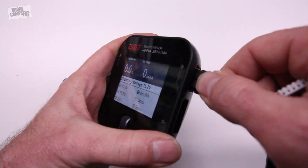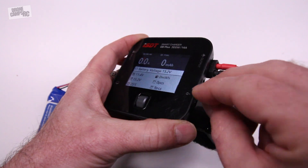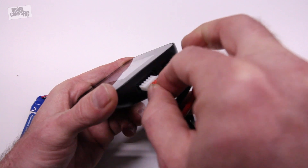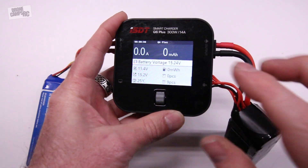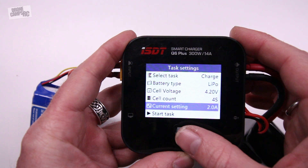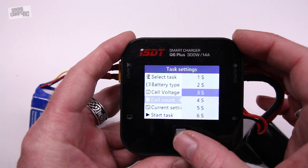If I plug this little 4S battery in, you can charge without the balance port plugged in or with it plugged in. I like to plug it in because it always beeps at me and asks, are you really sure you want to charge without balancing all of your cells? So most of the time I do balance charge — it takes longer, by the way. Now I have my 4S battery in there. If you push once, you can go and select how many cells you have — very important to do that. This is a 4-cell, so I'm going to leave it on 4S. You can go all the way down to 1S or up to 6S.